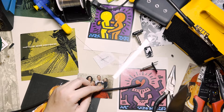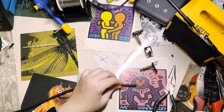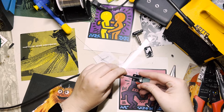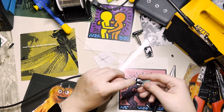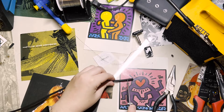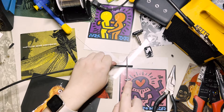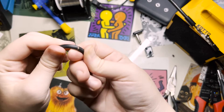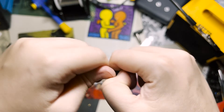The first thing you want to do is strip the outer sleeving — about half an inch is perfect for making square plug patch cables. We're going to use my favorite pocket knife for this, but any sharp knife will do. Here it is against the inside of the square plug — you want the narrow part of the plug to be fully secured around the wire, so don't strip it too far down. Put the cable against a flat surface and gently apply pressure with the blade, rolling the cable under the blade until you've gone all the way around. Now the braided shield is exposed and the outer sleeve can just be pulled off.